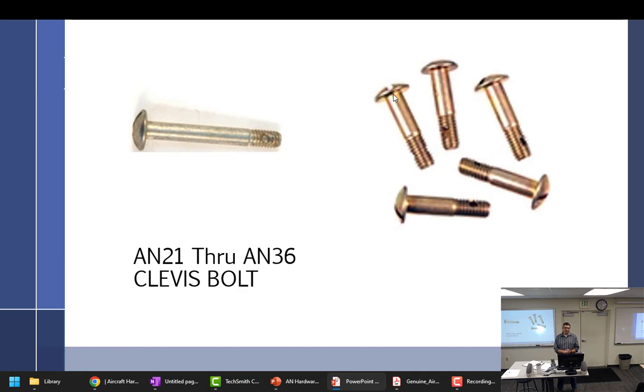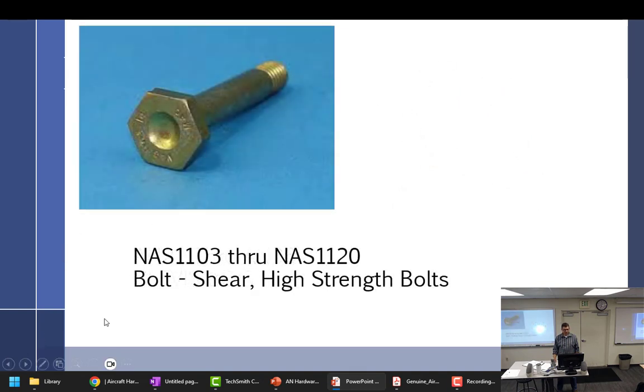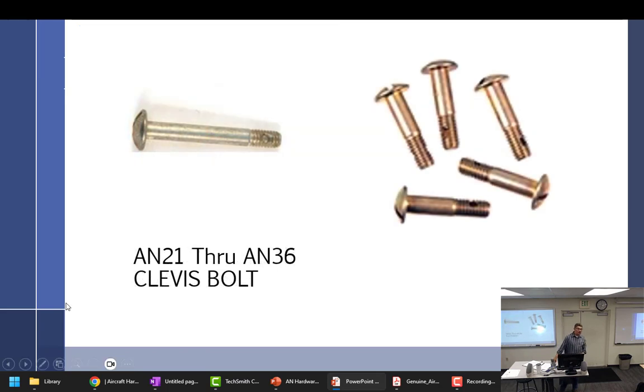So these are similar to the shear bolts we looked at before, where those shear bolts would have a rather hefty load upon them, high-strength shear bolts. We could have renamed these low-strength shear bolts, I guess. You see these used a lot, especially in more antique aircraft, as the hinge for elevators and things like that. So they are subject to rotation. You may have a horizontal stabilizer and then the elevator, and tubes are welded onto each one, and the tubes all come together, and this bolts through all the little tubes that have been welded on. This becomes the hinge. So it's subject to rotation.